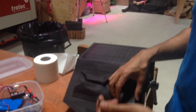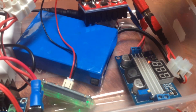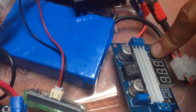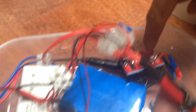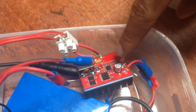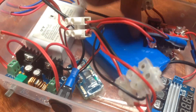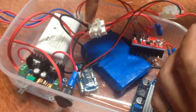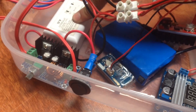We present Waterzilla. 12-volt solar panel, or just a wall socket with a 12-volt adapter. And this is a step-up controller turning the 12 volts into 18 volts. You can see the little light showing input and output. When you press this button you can see the input voltage and output voltage. Then that power goes into this charge controller — it takes 18-volt power and uses that to charge the 12-volt battery, which is here. The power comes out of the battery into this chunk here, and we have power going from the battery up through here to the switch. This switch turns on the UV electronic ballast for the UV lamp, which is over here.